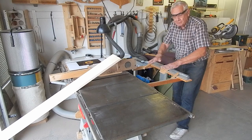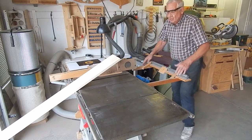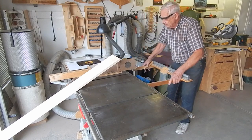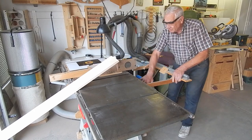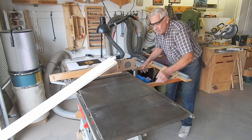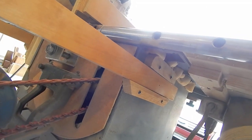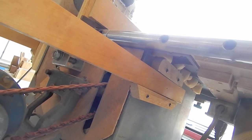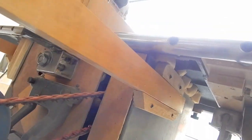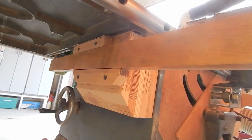You'll find that you need some small ramps to feed flimsy material up onto the roller given their small diameter, and channels on the underside of the table. The channel on one side is right close to the side wall of the saw, but to give the saw motor room to tilt when tilting the blade, I had to space the bar some distance out from the side wall. The channel under the left side uses a couple of hardwood strips with sheet metal screws holding it to the side wall of the cabinet, and on the right side you can see the spacers between the channel and the saw side wall.